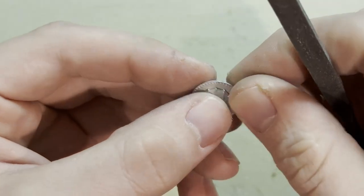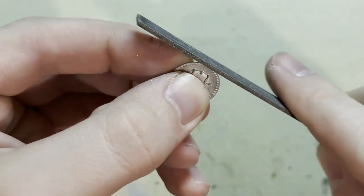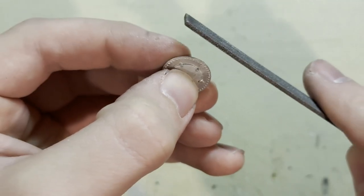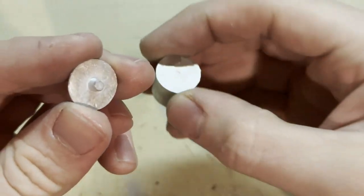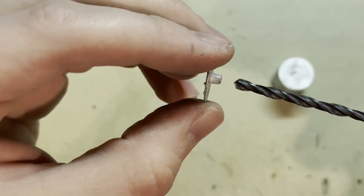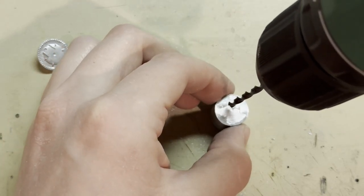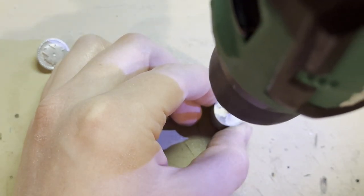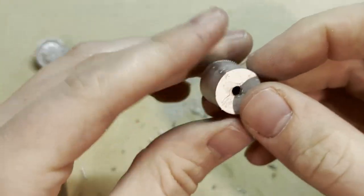Now I'll clean up the little bit of flash around the smoke box front — just a little bit here and there, so light filing around the edge. So at least one part of this kit was easy enough. Now I have to drill the smoke box front for that big tab. I have a 9/64ths bit hooked up to my drill. I think that'll be a good starting size. It looks like that didn't get quite centered on there, so I'll probably have to expand that hole.